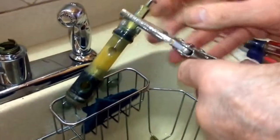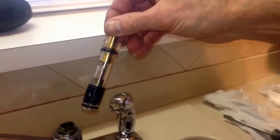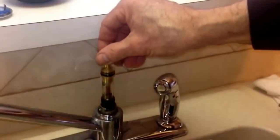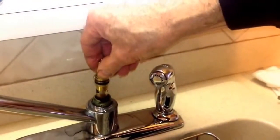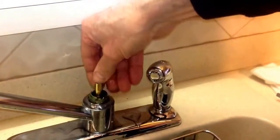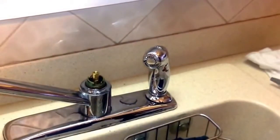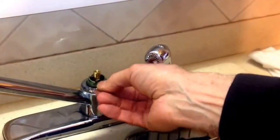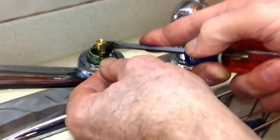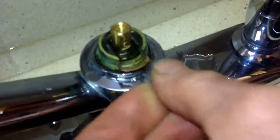And there it is. This is the new valve and we're ready to install this guy — just set it in. There was a little bit of water in there, so get this placed. Always put a little bit of grease on there so it goes in a little easier. He's in there, and next we slide in our C-clip. You have to reposition it a little bit in order to get the C-clip in there.